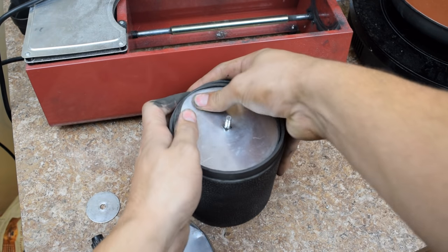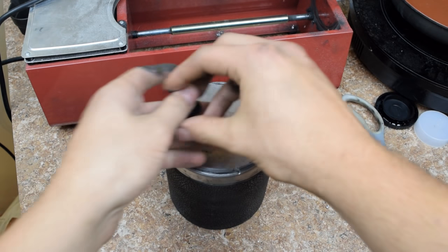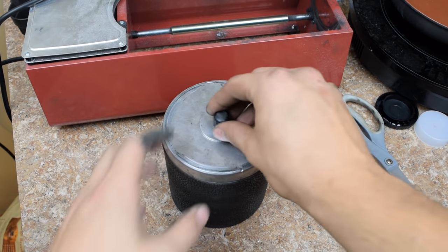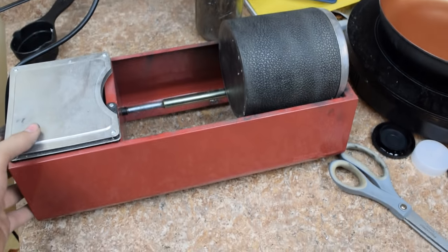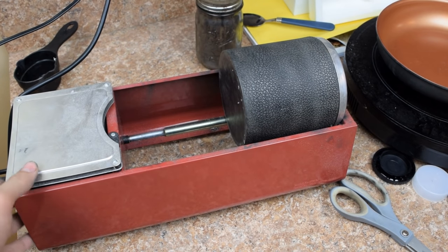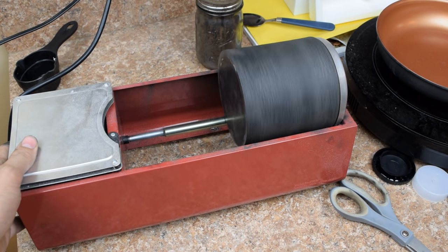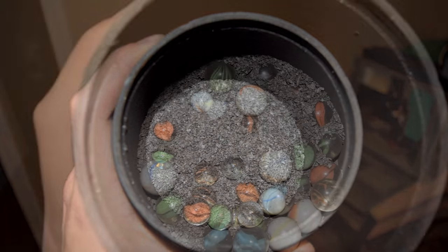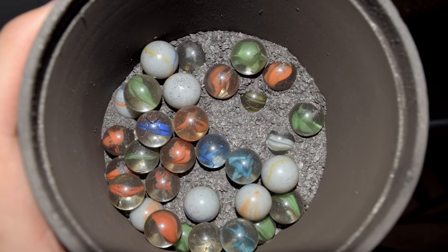But here is yet another safety precaution you need to take very seriously. You have to open your milling container at least once a day, or preferably twice a day, with at least 8 hours of milling in between. Otherwise, the aluminum you are milling can consume all the oxygen in the milling container as new surface areas are exposed on the granules. This slow oxidization is harmless, but if there is no oxygen in the container for several days and you suddenly open it and let oxygen in, it can rapidly bond with exposed aluminum to create aluminum oxide — generating enough heat to light your aluminum pile on fire and just about anything else it touches. Plus, if you have a plume of dark aluminum dust around you, that can also ignite, causing a big bright fireball that can give you second degree burns and blind you from the radiation it produces in close quarters.